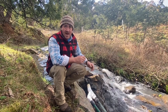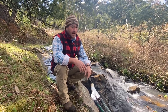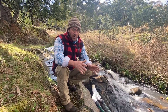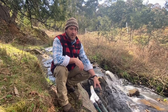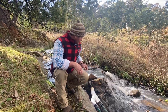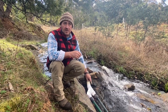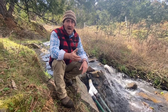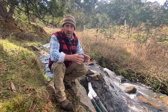When we did our last test we were achieving 22 litres a second off a 90mm pipe. I'm still in that phase of not quite sure how this is all going to work. I've found some poly pipe off a neighbour who's going to let me use it for a little bit. These two pipes here are 45mm each, a total of 90mm. What I'm trying to achieve is the same volume as when we were doing our standard 90mm pipe.